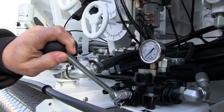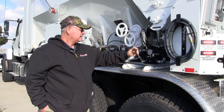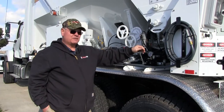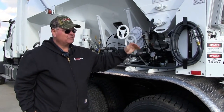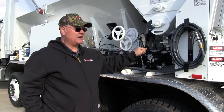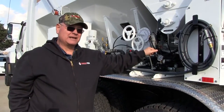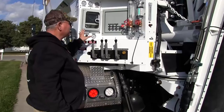This is your control valve to start the hydraulic motor. It's just on and off, and there's no reverse. When you get ready to run, you want to start the pump before you start mixing concrete. Always shut it off when you're done running — you don't want that pump to sit there and run for a long time shearing the latex.